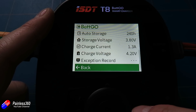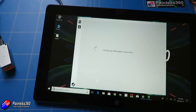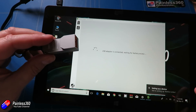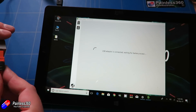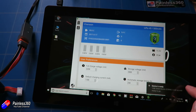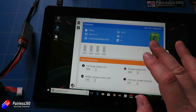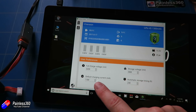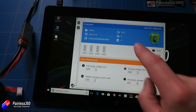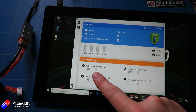Now let's plug this into the PC using the PC adapter and see what we can see on the PC app. You can download the application and install it onto a Windows PC. I'll install the Batgo adapter — I'll put a link in the description — and plug the battery in. All of the data is coming down that single connection from the onboard electronics inside the battery. Here we can see all the cells, the charge current, the discharge current, the overall battery voltage, the number of times it's been cycled, the target voltage, and the charge level. That charge current shows 1300, which I reduced on the charger before the video. The charger should be able to figure out the maximum charge current and whether you're trying to charge the battery faster than it can handle.